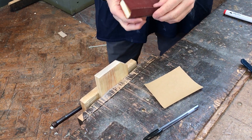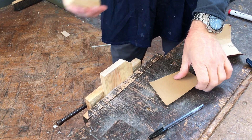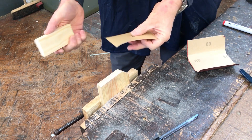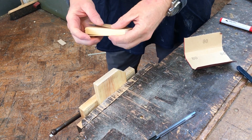What we're trying to do is remove all the marks left by the saw or the belt sander. After you've started to sand, never take it back on the belt sander, because it will just rough it up. So now use the 240 — wrap that around a piece of wood.